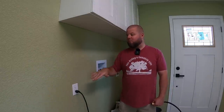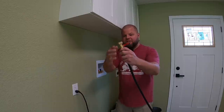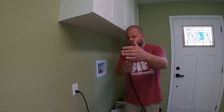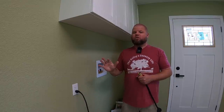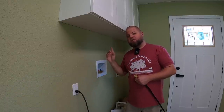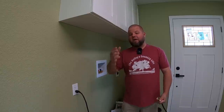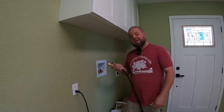I've opened up some drain valves on the hot and cold water side on the outside of the house and bled the system down, but there's still water held in the pipes up in the house. I have my little pancake compressor hooked up with fittings from Amazon that hook up to my washer and dryer hot and cold water hookup. The regulator is set to about one to two PSI — I don't want to heavily pressurize the system. I've also cut off the valves entering the water heater so I don't force flow the wrong direction through it. I have hot and cold water drains ready to blow what little water we can out in the yard, because we're about to cut some low pipes for the toilet and vanity and I don't want them draining water on the seams we're about to glue.